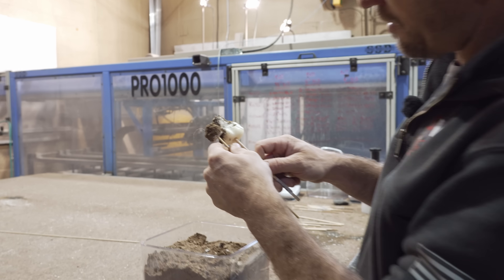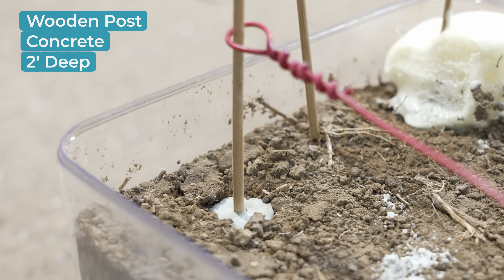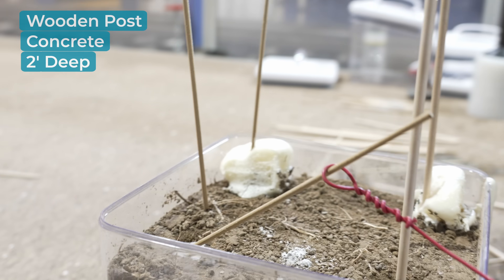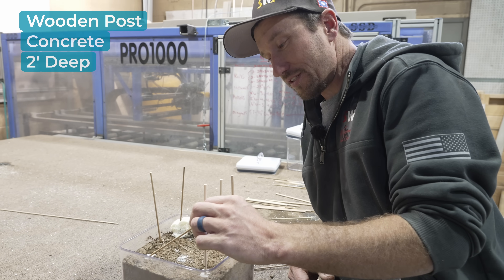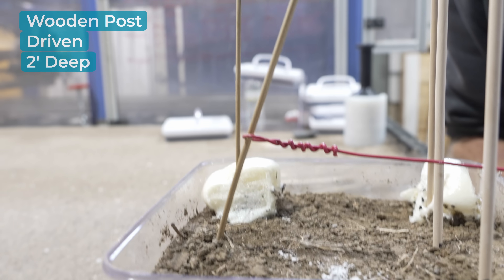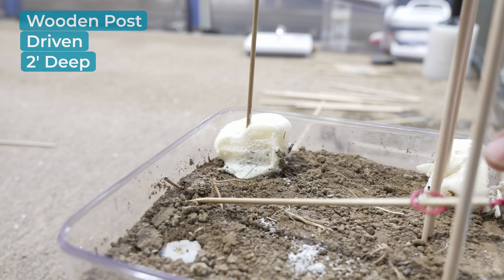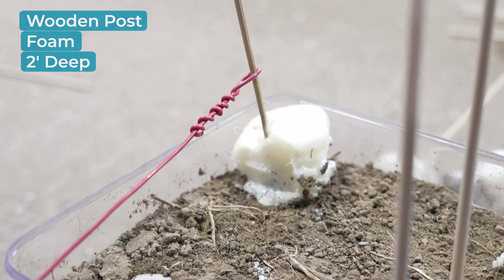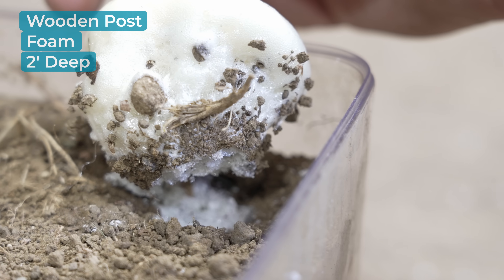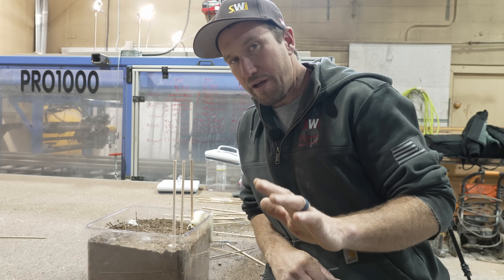You can see from our concrete to our foam that we had exactly the same amount of depth in the dirt. Now let's grab our two foot, starting with the concrete. You can see how hard I'm pulling on that — the post is flexing. Oh, it broke right there at the bottom of the concrete. So one foot wasn't sufficient, but two feet — the post broke at the base. On the foam: the post is stronger than the hole depth, and the failure point yet again is the depth of our hole.